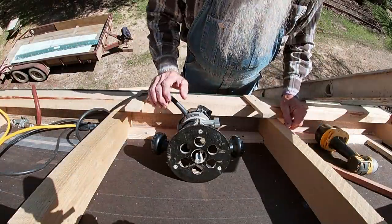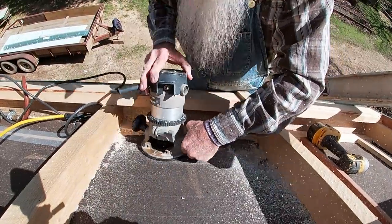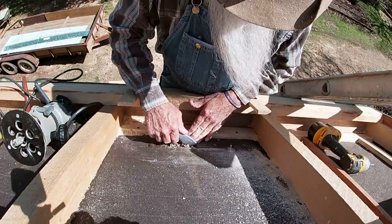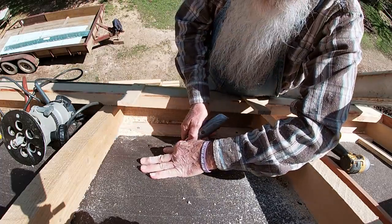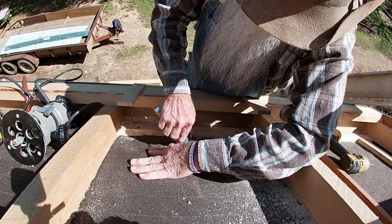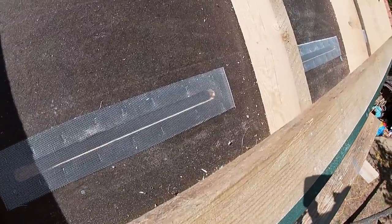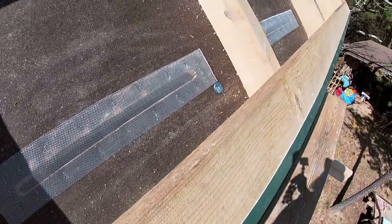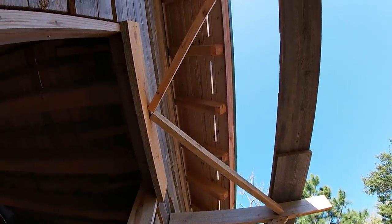I'll rig up and cut one of these — there's going to be some dust, so watch your eyes. I'm trimming the tar paper back because it tends to fray. With that screen wire over the slot, it'll keep the mud daubers or dirt daubers from getting up in here while still allowing airflow. Those slots won't hardly be noticeable once the metal is on the roof — of course there's sunshine coming through them now, but when the metal's up you'll have to look to find them.